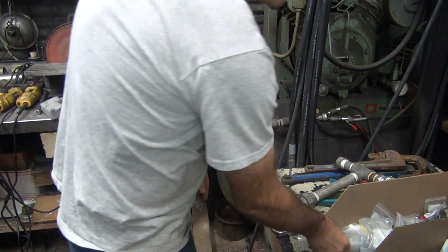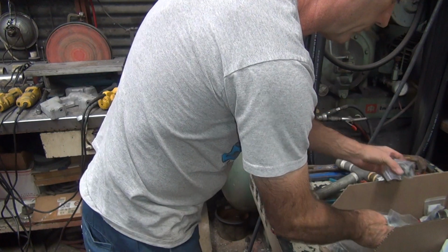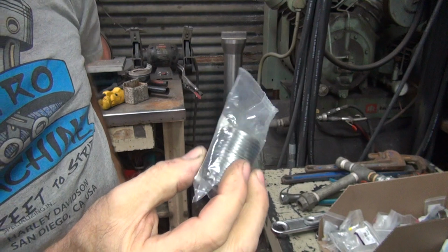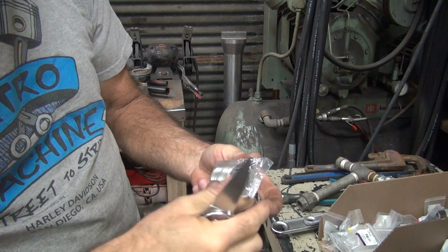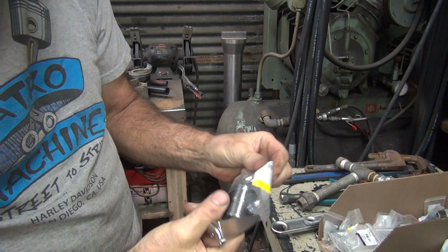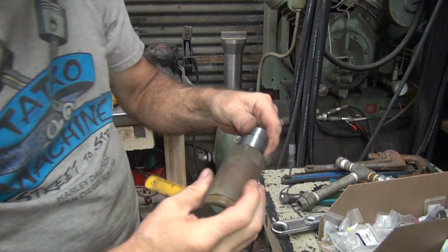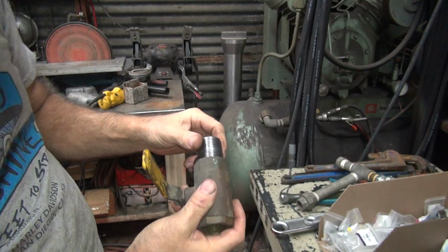From there to there, that's a little nipple. Be a nipple. This is not a titty type nipple, this is a nipple. Big difference. Factory sealed. Galvanized on the inside, threaded everywhere else. Okay, so that goes into here, like that, and also threads into that pipe down there.